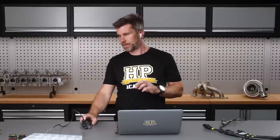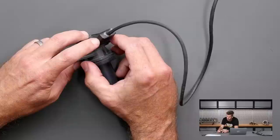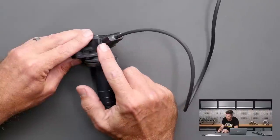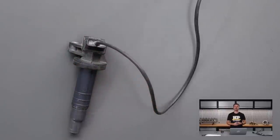Now we're reasonably vocal in our dislike for solder, and I still stand by that, but for every rule there is an exception. The biggest problem with solder is that it will wick up the conductor, especially when applying too much heat or solder, and the failure point is not the solder joint itself but where the solder stops and the wire conductors continue — that becomes a potential failure point under vibration. With our approach, all of our soldering is done inside the back of the connector body, keeping the wicking effect contained inside it. Then by filling it with a two-pot epoxy resin, we get mechanical strain relief — the solder joint is locked in position, it can't vibrate, so the failure mode is essentially eliminated.